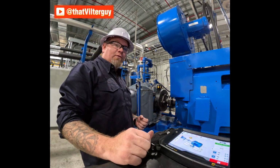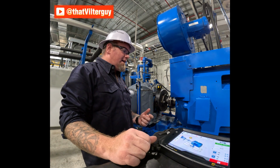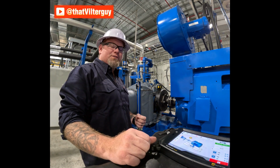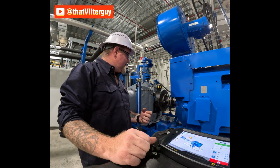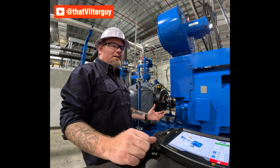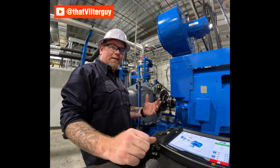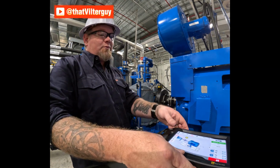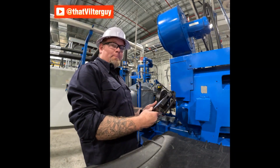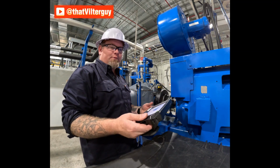I've told customers before, come back within 500 hours and check it. But of course, that depends on how much vibration you have at that initial start. If you're not vibrating, you just want to come back and do a check later. This is just a regular check and inspection. So I want to make sure that we're relatively close to what we were at last time. And again, a nice thing about these lasers, we have that report. It's right here in this device, and I can go back and refer to it.